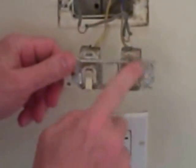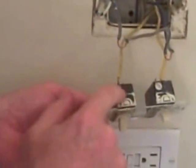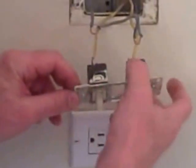On the bottom we're going to disconnect these two. What I didn't like about the original setup was they had the fan hooked to the first switch and the light to the second. Most people, when they walk into a bathroom, want the light first — so we're going to make sure we put the wire going to the light on the first switch and the wire going to the fan on the second. You can see how burnt this screw is. Because the box is metal and these wires were exposed, when someone was removing this they touched the screw against the metal box and created a short. That can be potentially dangerous, especially if you're working with live wires, if you don't cover this with electrical tape after you tighten the screws down.